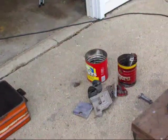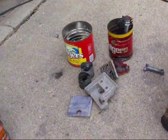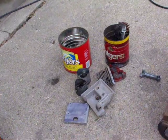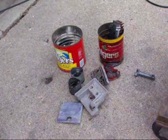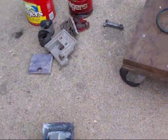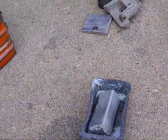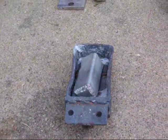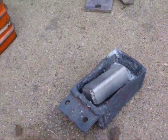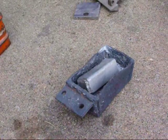Our source of metal is always cast aluminum. Don't use extrusions or die castings. Try to find cast aluminum of good quality, like pistons. I'll be pouring it out of this homemade steel crucible and I've already got some metal in there, so that's ready to put into the furnace and start here momentarily.